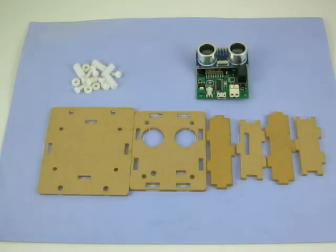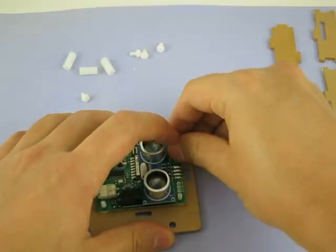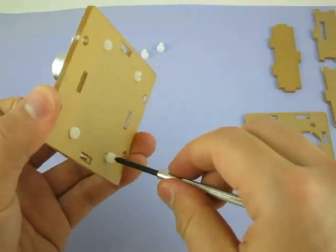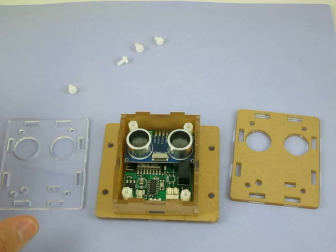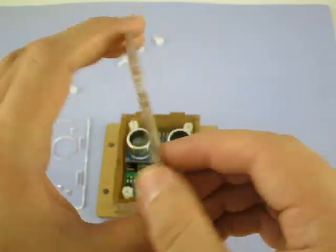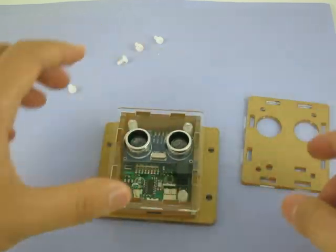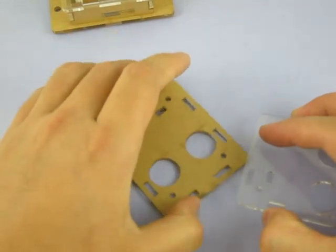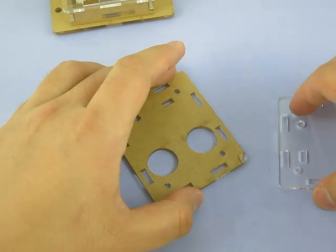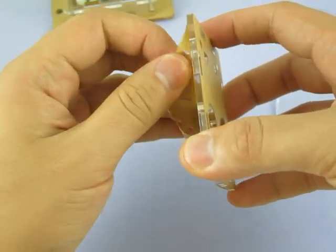After the laser cuts arrive, it will be a fun time to assemble them. Here I will show you an example of assembling the enclosure and the PCB together. All the pieces come with a brown sticky paper cover to protect the surface during laser cutting. I often like to use plastic screws and support pillars, because they are much lighter than iron and copper ones. If the material is transparent, you can peel off the protective paper cover, then you will be able to see through the enclosure to the circuit inside, which is pretty cool. The easiest way to peel off the cover is to actually use another acrylic piece. Acrylic is generally pretty scratch resistant, so this is totally fine. Don't use your nail as it can easily damage your nail.